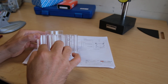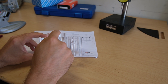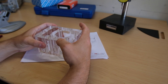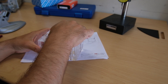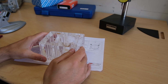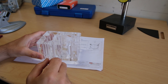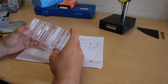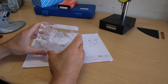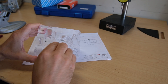The shape it has is kind of barrel-shaped — in the center it's opened up. I think it was about 48.12 millimeters in the center and then 48.02, 48.08 millimeters. It seems like maybe they were milling it with a boring head and it actually opened up in the middle. I still wouldn't hesitate to use this company, Sunpi. They've always done well, especially on bearing fits and tight interference fits — never had an issue with production runs. These dowel holes are pretty much perfect; they fit, no problem. It's a tight fit, which is what you want, but not excessively tight.